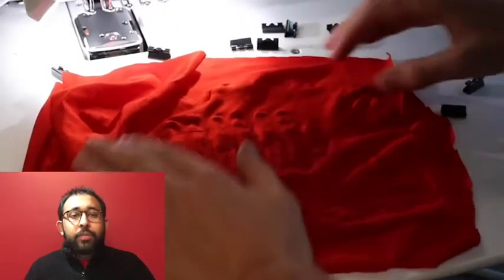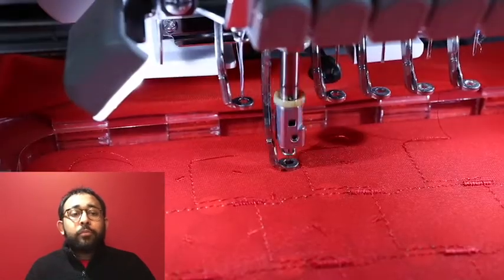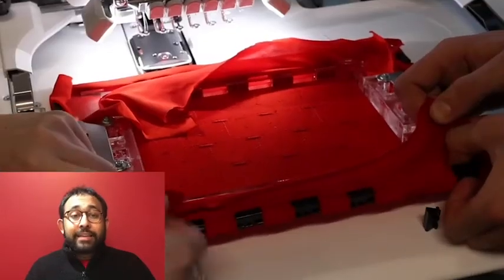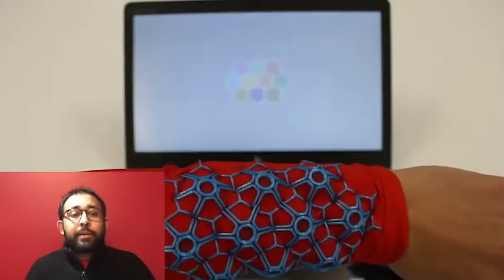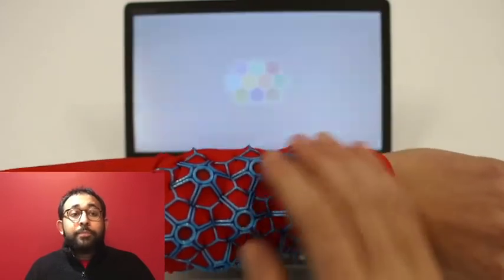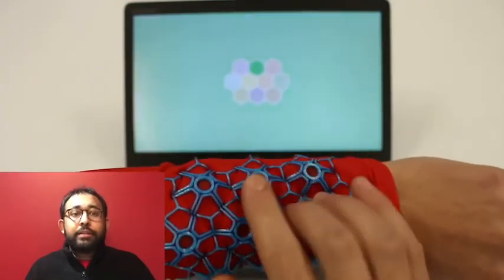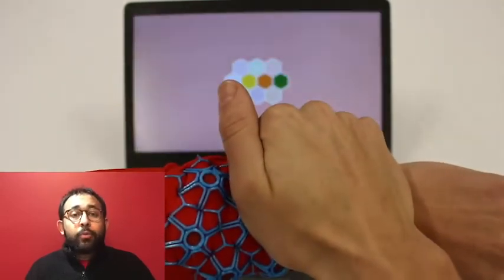To create the buttons, we embroider and 3D print on two separate layers, later joining them with embroidery to create a combined e-textile. Finally, we remove it from the frame and interface the buttons with the microcontroller. As a result, the tactile pushbuttons become an eyes-free wearable interface, providing 3D physical landmarks and clear haptic feedback when the wearer is using it.